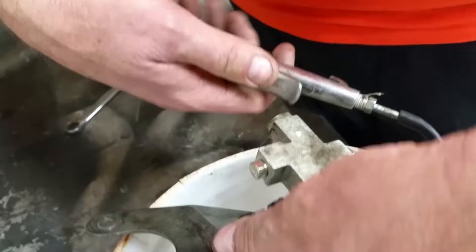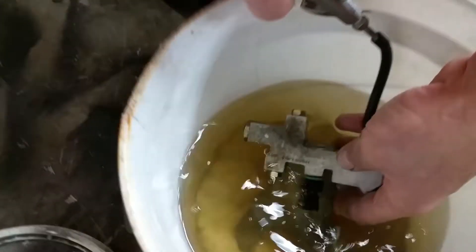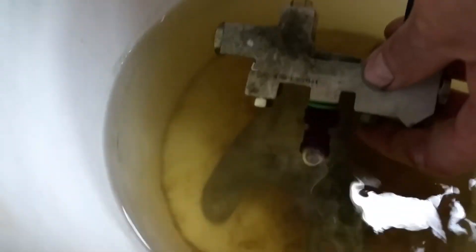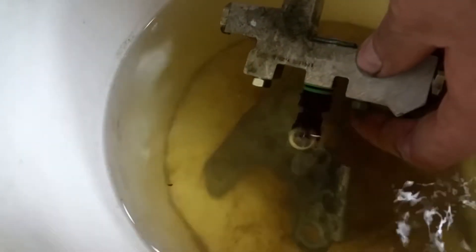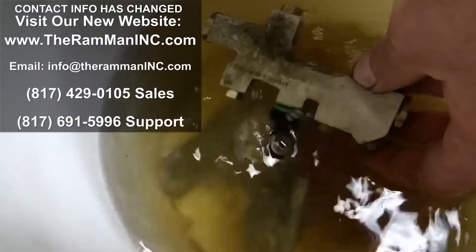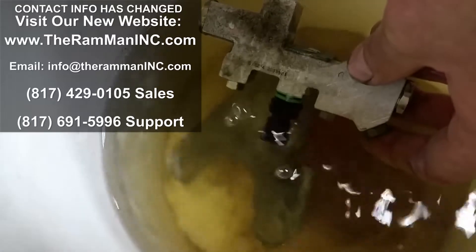Simple, fast way to test the prop valve for leaks — where it's leaking, the metering valve, or anything else. And watch there. Look at there — right up through the pin connector. It ain't leaking anywhere else. See that? All the fittings are good. Just right there.